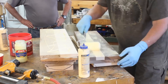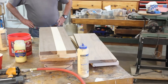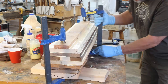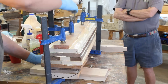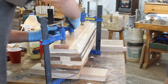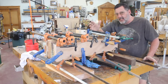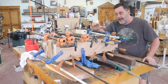More glue, more roller — going pretty fast here, and the brad nailer works really well. This particular clamp is awesome — I got it from Woodworker Supply years ago, and I've got four of them; they're really hefty clamps. I'm adding a few more clamps. Well, there it is — about a quart of wood glue and a lot of clamps. I've got to wait at least 24 hours before I do anything with this.